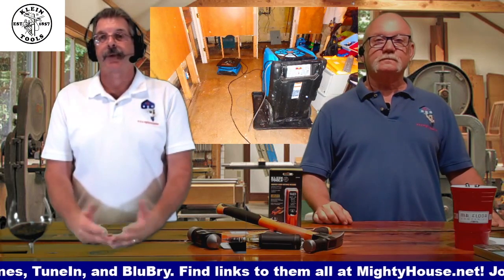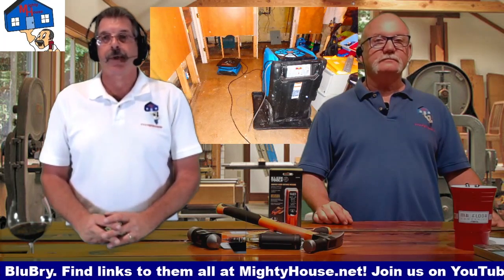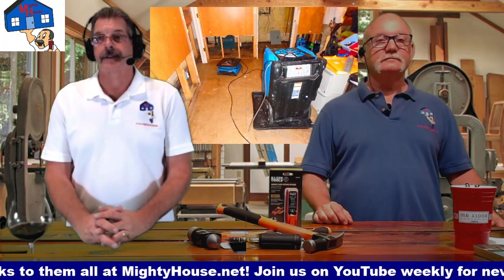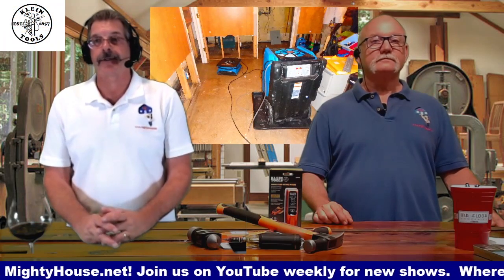Well, again, it goes back to building for it, right? If you live in a flood-prone area, then we don't put drywall on the walls. You can do all your walls in Durarock and skin coat it. And it's non-organic, never have to worry about it. Metal studs, too.